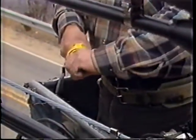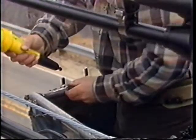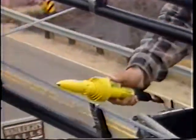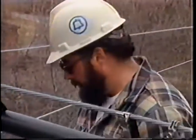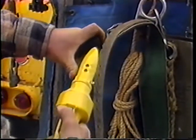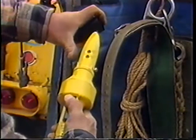Attach the conductive probe tip cap to the handle and connect the ground wire to the tip. Now, retest. If the set is giving you a green light, foreign voltage is not present. You can proceed with your job safely. Did the trick, John. Remember, in time, conductive probe caps may lose their conductivity. To make sure they're still working properly, test them by introducing the conductive probe cap into the self-test circuit.